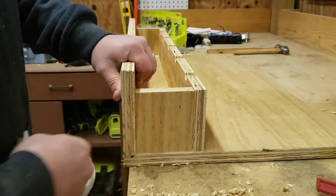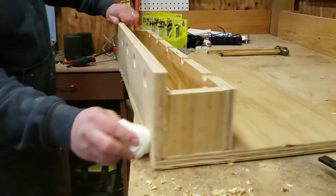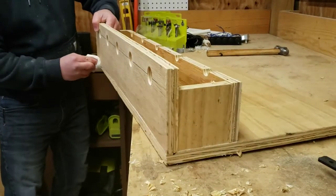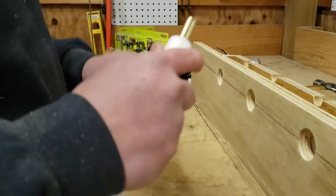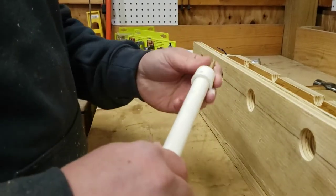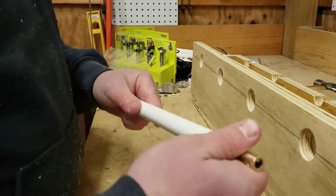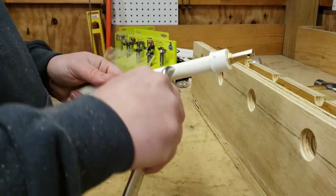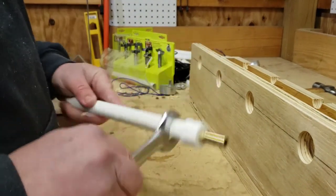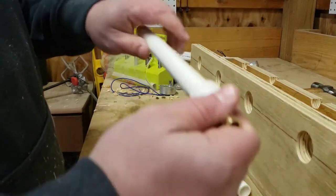Dry clear, so you can just clean up any excess. Not a big deal at all. Alright, so you remember that I told you you want these pipes to be removable. When you first get these, they are pretty snug and you almost think that they are not removable. Just find an open end wrench or an adjustable wrench, like a crescent wrench, and you just slide it on there and you can tap on it. And then after that, they're pretty easy on and off.